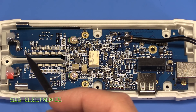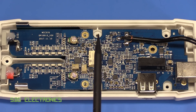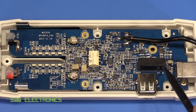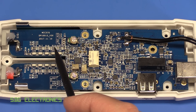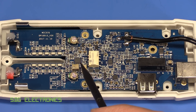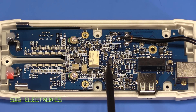Here's the inside of the differential probe. This is basically acting like a high-spec instrumentation amplifier that can tolerate a very high voltage differentially on its inputs and also provides some means of current limiting from the input to the output so that you don't get an electric shock from the output terminals. The way it achieves its safety is by way of a resistor ladder — effectively five 1-megaohm resistors on each leg, providing around 10-megaohm impedance into the main op-amp. That op-amp is an Analog Devices ADA4817, which has FET inputs for very high input impedance and very low noise.